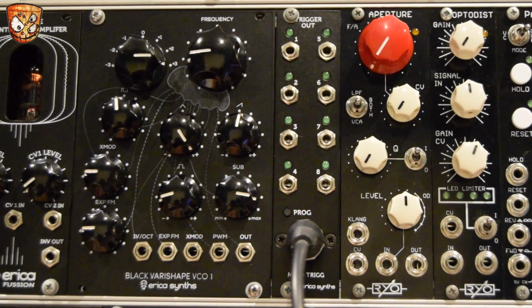I'm going to use 6 outputs for drums, which I'm going to mix in and show you in the patch. I'm going to use output 7 as just an 8th note clock, which is going to clock my sequencer, and I'm also going to use output 8 as a reset. And notice when you're looking at this Audio Damage Sequencer 1 I'm going to show you in the video, it's actually going to hit beat 1, and then the reset hits just after, so it's going to step back, and you're going to see this on the LEDs move. You'll see the drums as well.